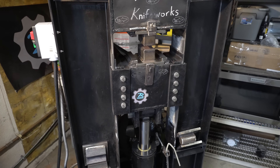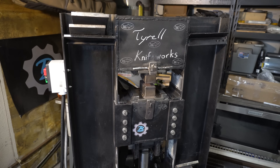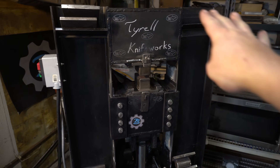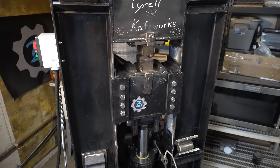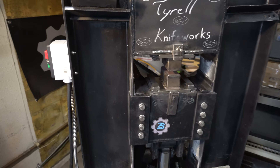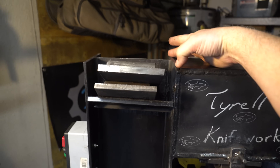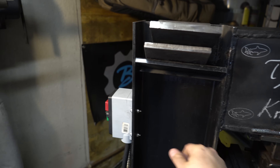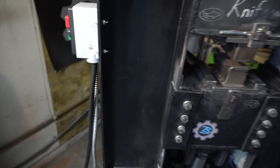Let's talk about the press. This is what's called an H-frame. It's one of the most solid press designs, just because of the vertical beams and then the crosses. It's not like the C-style where you get a little more flex, so this one's really solid. The construction is all solid I-beam — five inch by eight inch I-beam, probably three-eighths thick.